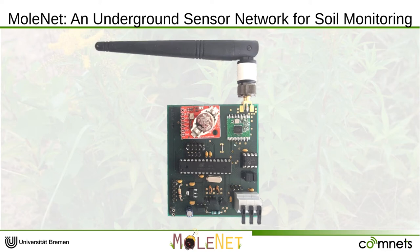The gray part in the lower right is our sensor interface. Here we use SDI-12 to communicate to some standardized soil sensors, which offer, for example, the volumetric water content, conductivity, temperature, and so on. We also have some external flash memory for long-term data storage of the measured data. The black thing on the top is the antenna for the 433 MHz transceiver.